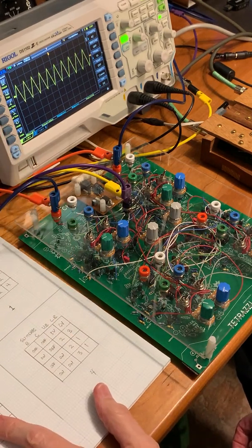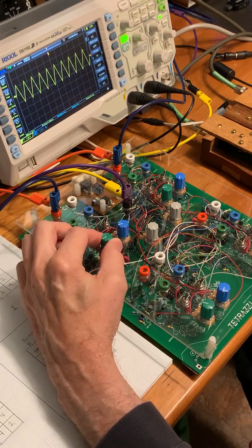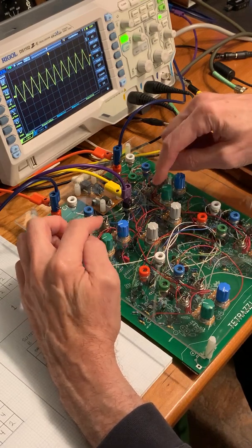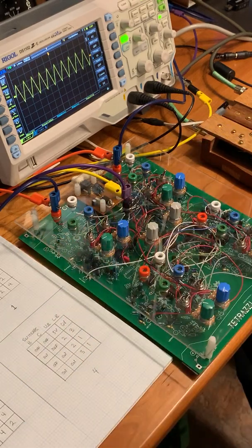Now there's another thing that I did. I should mention that on the actual Tetrazzi organ, we don't get independent rise and fall times for each oscillator. What we get is a wheel that works in parallel, all the rise times and all the fall times, which are called upton and downton in Peter Blasser's lexicon.